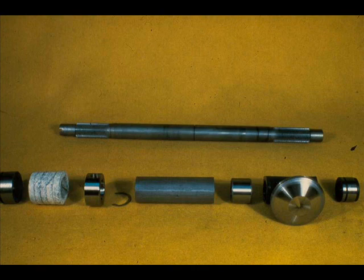This exploded view shows the valve internal parts that fit on the shaft. They are, from left to right, the packing follower, packing, packing box ring, retaining ring, spacer tube, upper guide bushing, plug, and lower guide bushing.